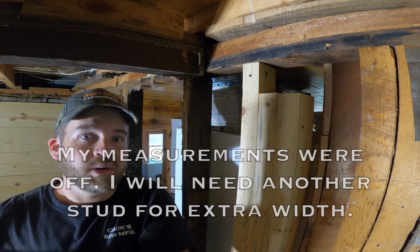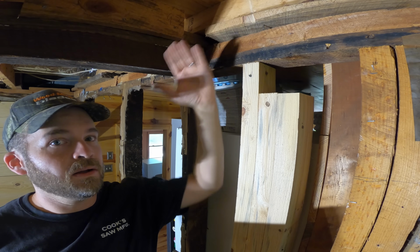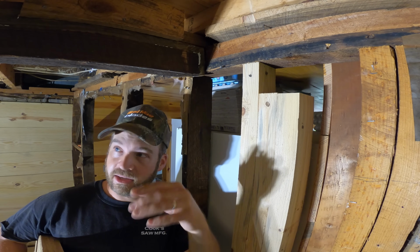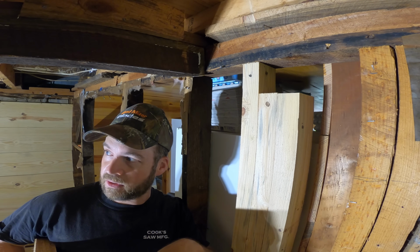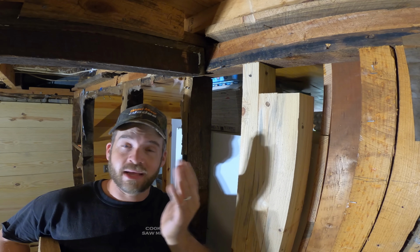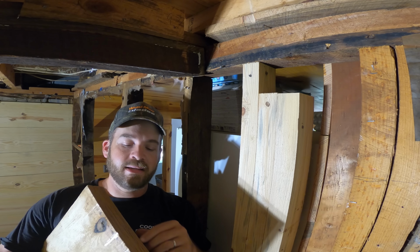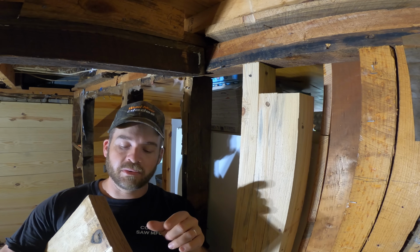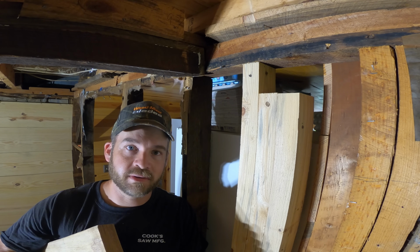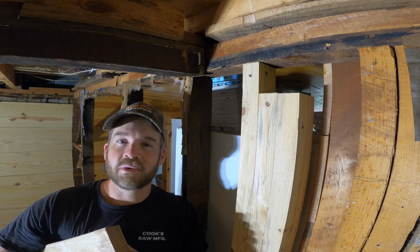So basically what's going to have to happen here is this is going to have to be cut out and then all tied back together once it's in there, and that's going to require, of course, bracing to go from the ceiling down to the floor so that our house doesn't fall in once we cut it in half, because we're basically cutting the house in half. We're going to be cutting all these joists and tying in new joists sistered to the old ones onto this triple LVL beam, and that way we're not going to have any post in the middle of the living room. We'll just have one single beam holding the whole thing up. So that's going to be our task for the next living room remodel.